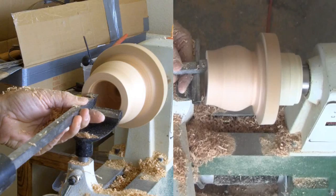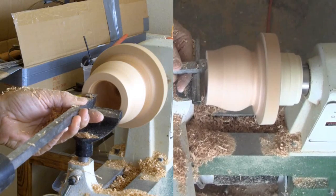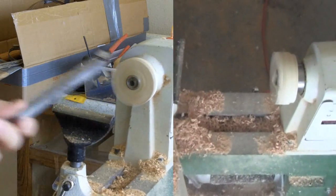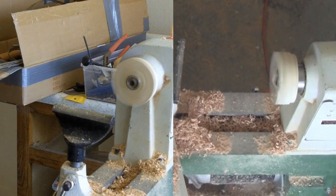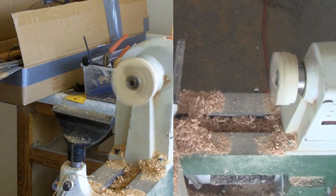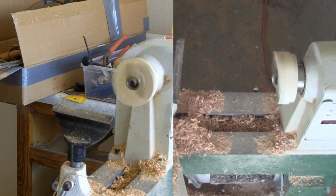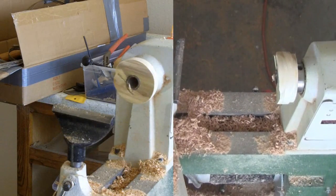Whoops — what happened to my squash? Did it get squashed? It turns out that one of the layers in the faceplate must have had a split that I had not noticed. It was from the end of the board and gave way. I glued it back together, then reinforced the faceplate with several quarter-inch dowels drilled in from the back, nearly through all the faceplate layers. Fortunately, it did not throw it off very much.